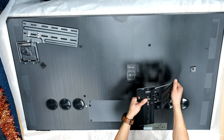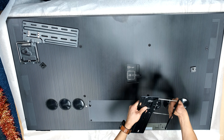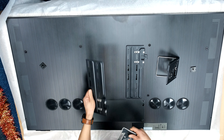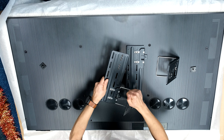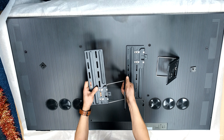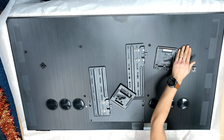Top tip for these brackets: before you put it on the wall, snap the bracket in and twist it out again a couple of times, just so it clicks down easily when you eventually put the TV up. If you don't do that first, you're putting so much pressure on the TV to click it down that there's a possibility of breaking it. Do it a couple of times on each side — snap it down, twist it out — just to make it easier.